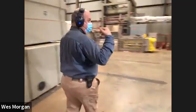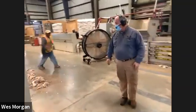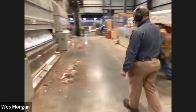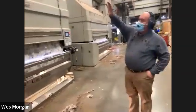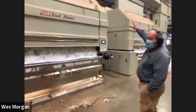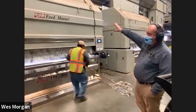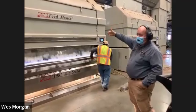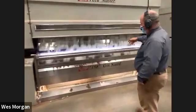So then it'll bring a conveyor above our heads here and bring it and drop it into our gin stands. Got them back to going now. So basically, it's coming and dropping it into this gin stand, and then this one, it keeps them both full. This is another cleaner right here. It's feeding the cotton in at a certain rate. This is the cleaned and dried cotton.